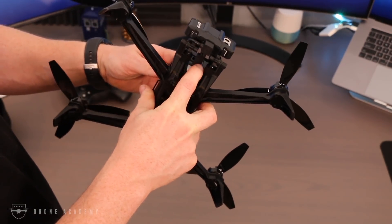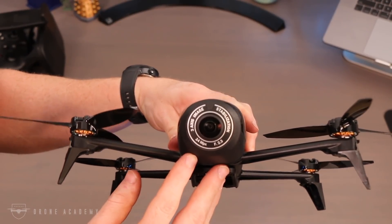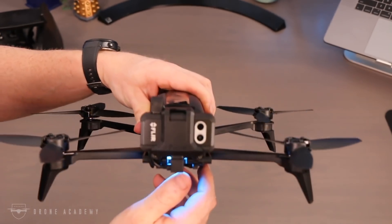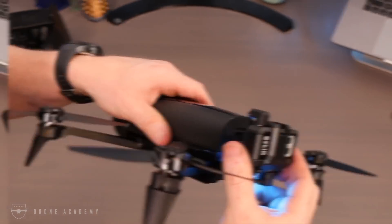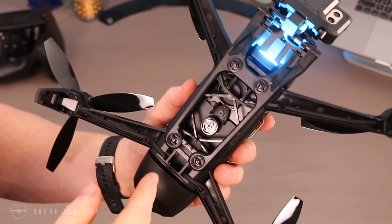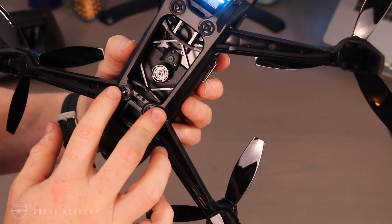This aircraft has three cameras — two on the FLIR, and one on the front. Let's get it powered up. This 14-megapixel 1080p shooter on the front saves all its images to 32 gigs of onboard storage. The front camera does have three-axis image stabilization, but it is digital and not from a gimbal, so keep that in mind when looking at performance. On the FLIR ONE Pro unit itself, you have a 160x120 thermal imager as well as a 1440x1080 standard daylight imager, and you can overlay those two into one image, which is pretty neat. On the bottom there's a small fan to help keep everything cool, as well as an altimeter.